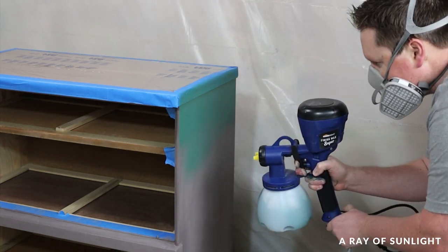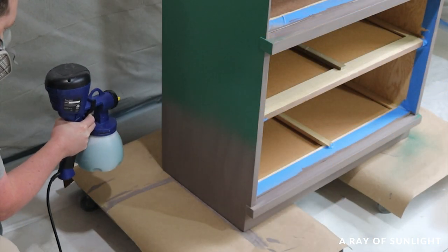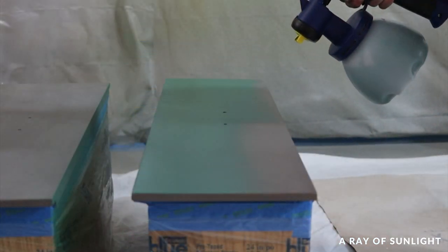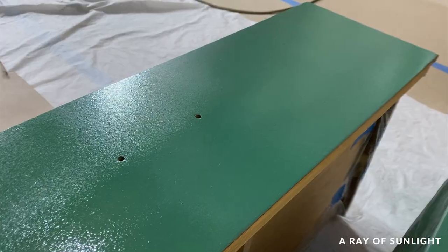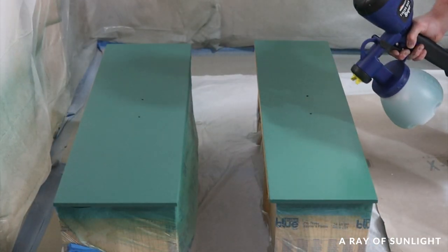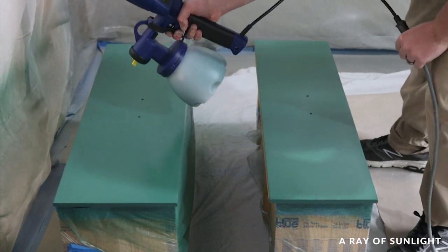Remember, this is my first time really using a paint sprayer to paint a piece of furniture, and I was actually pretty nervous. I really wanted him to try spraying without any extra help from me. So I got started spraying the first coat, and it took some getting used to, but by the end of the first coat my confidence was growing. Turns out I sprayed a little too lightly and the paint was more textured than I wanted, but overall it still looked pretty good. When the first coat was dry, I sprayed the second coat, this time adjusting the paint sprayer to spray a little heavier to try to get a slightly thicker coat of paint in hopes that it would self-level better for a smoother finish.